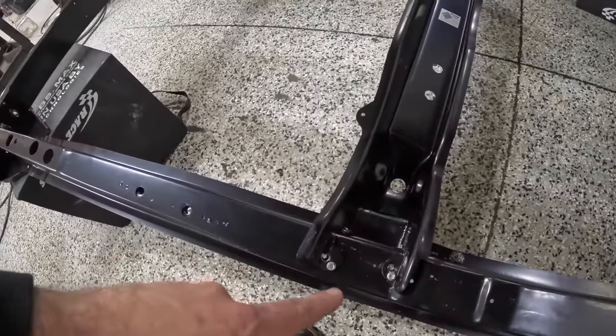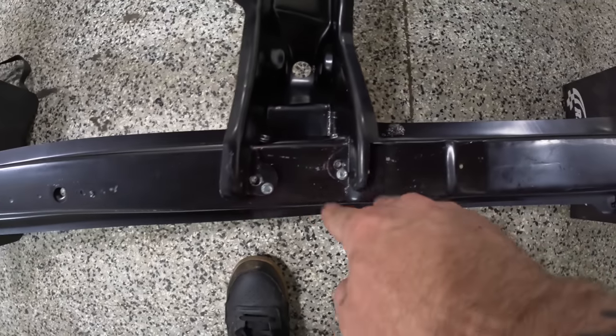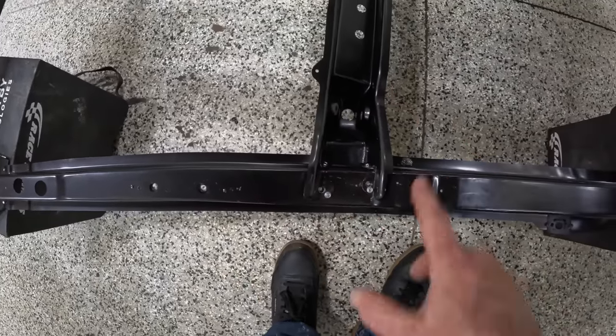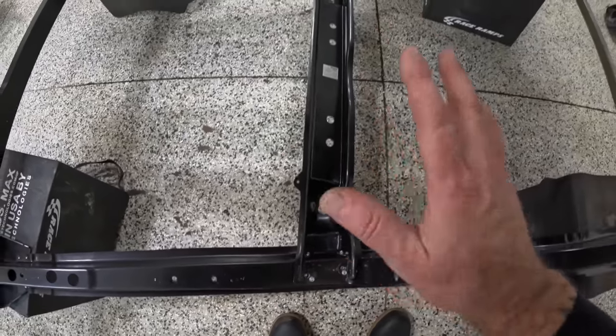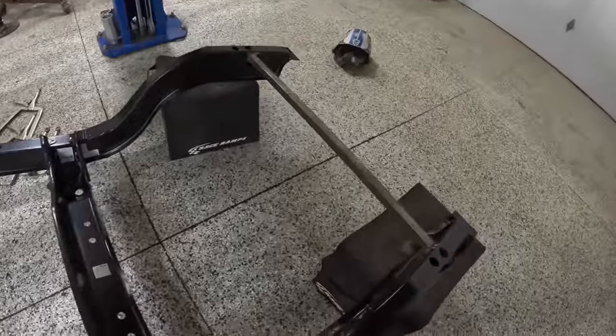The strut mount here, again, I took measurements and used a lot of different things as reference points, to mount bolts, this bump stop, front to back, up to these holes here. I mean, try to measure it in as many places as you can, get it as close as you possibly can. And again, at the end of the day, the car ain't perfect as it sits today.